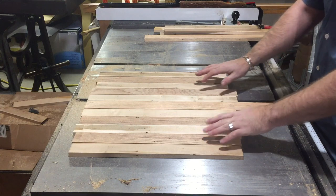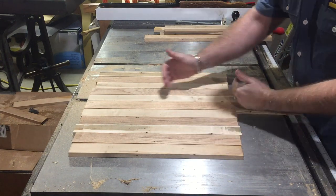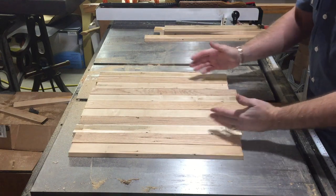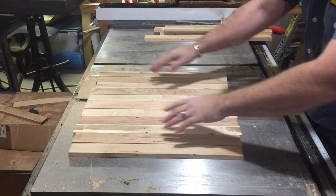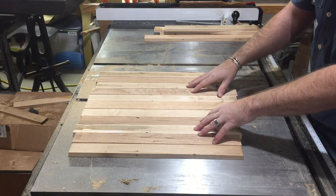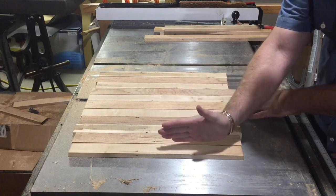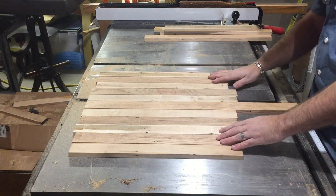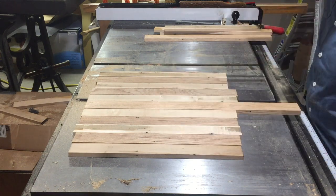All right, so here's a basic layout. We're going to go again 18 by 16 with an 8-inch handle. I'll round it up, I'll form all this, and bevel all the edges. I've alternated oak, maple, oak, maple, oak, maple, and ease all this with a hand plane, glue it all together, and there we go.